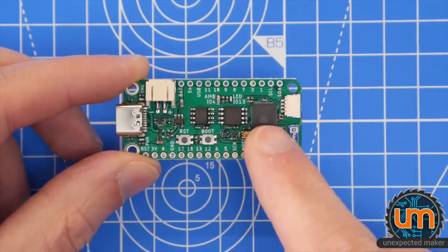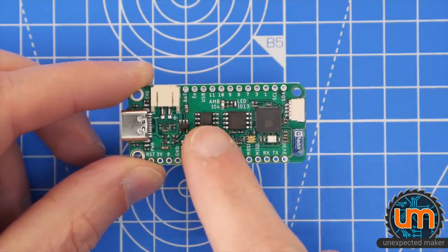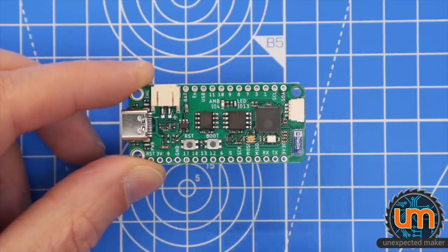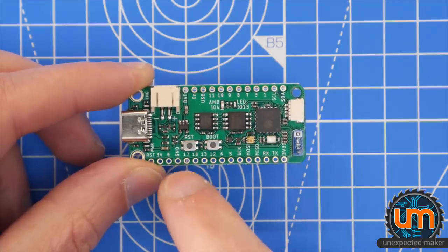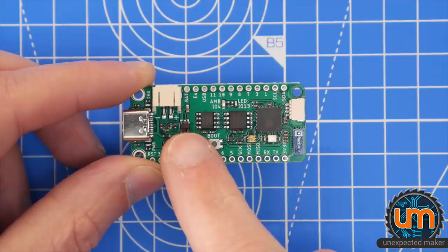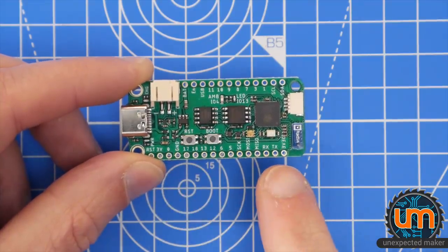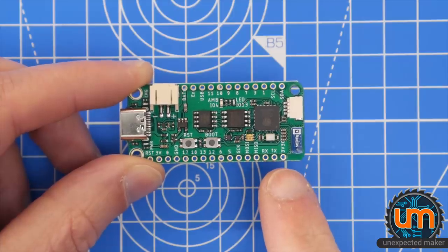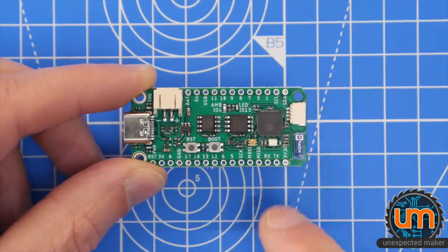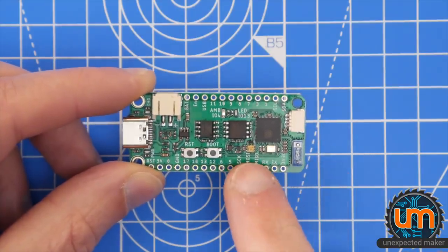It's got an ESP32-S2. It's got 16 megabytes of flash, 8 megabytes of PSRAM. That's stacks. It's got two onboard LDOs, 700 milliamps. The first one drives the general board. The second one is a user controllable one that has a 3 volt output only here, so not an input, just an output, that you can connect external modules and sensors and OLEDs to. It also drives the APA.